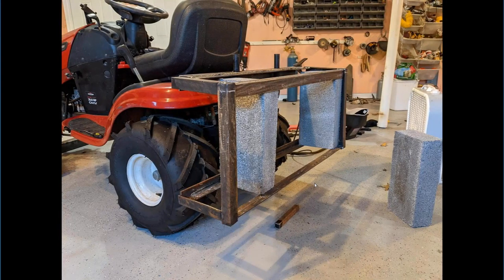This is where I'm experimenting with how I'm going to hold these weights on. The idea was that I wanted the most weight close to the actual source of power on the transaxle, and I didn't want it to be wider than the overall machine so I could fit through the places I have to go. That ended up being around 10 cinder blocks, which are 33 pounds each — 330 pounds of counterweight.